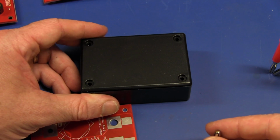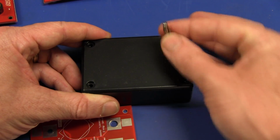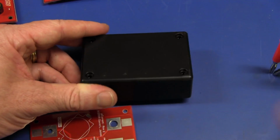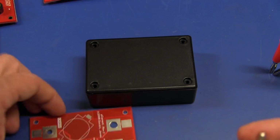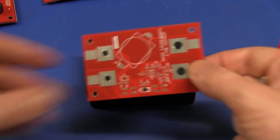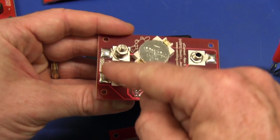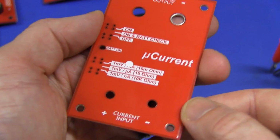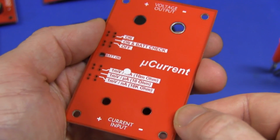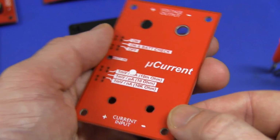And of course, the first thing you might think of is get a box like this and put in some banana plugs or some pogo pins or other test probes or something like that. But why? It's very common to use the existing board of your product, because it's already got the holes aligned for you. Everything's there. So what we'll do is we'll just use an existing reject board for our test jig. This one's got a big silkscreen blotch on it. Check that out. So, you know, can't sell that one.